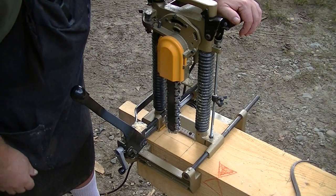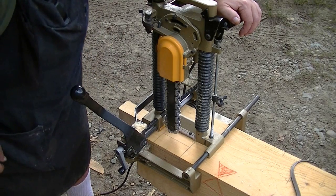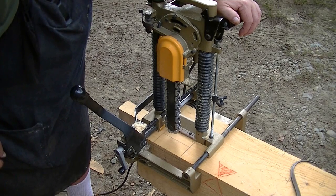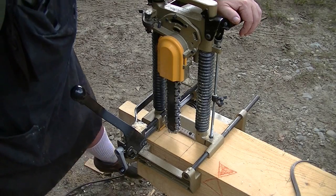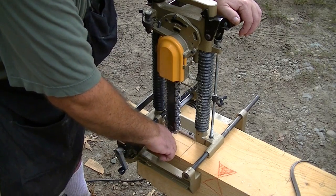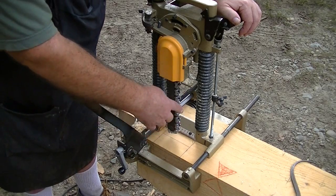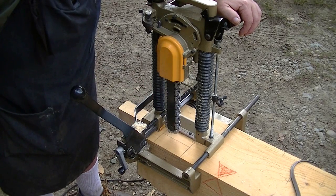Today's project is a three-inch deep plus housing mortise for a girt that's going to be a door header in the side wall of the frame. This is square rule layout, two by two — a two-inch offset and then a two-inch mortise. I've scribed the outline of the mortise with my utility knife so that the chain mortiser won't chip out beyond the scribe, which is my standard procedure.